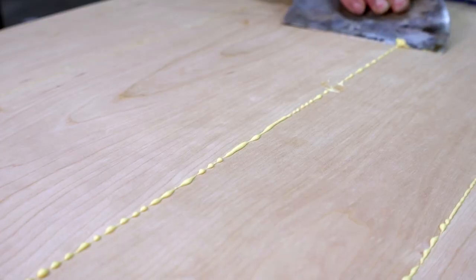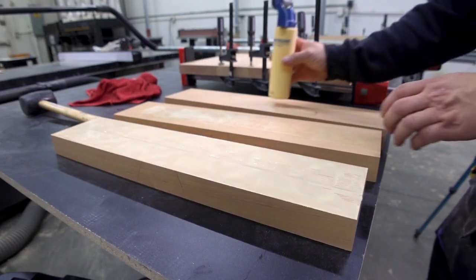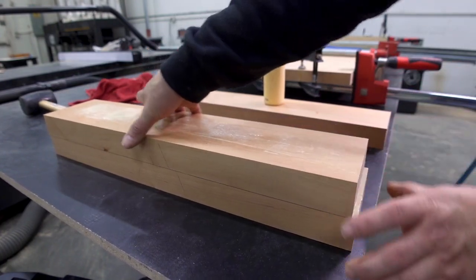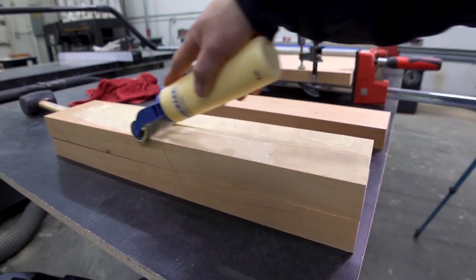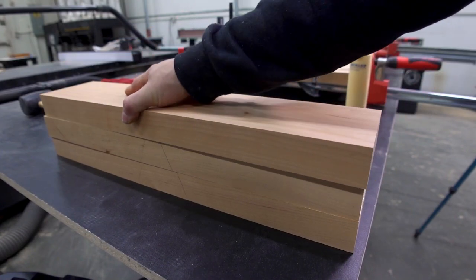It took me 6 years to figure out that using a drywall knife is perfect for cleaning up the squeeze out. 6 years. For the turned legs, I'm laminating a thick block together for a blank. I do use light glue on both mating surfaces for face glue-ups because that large of a surface area sometimes is hard to get good squeeze out if only one side is glued.